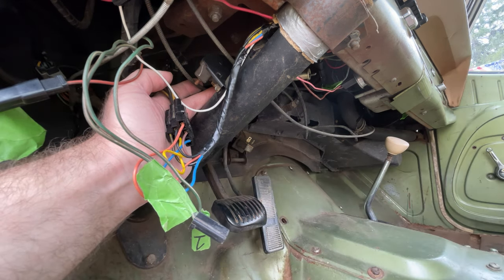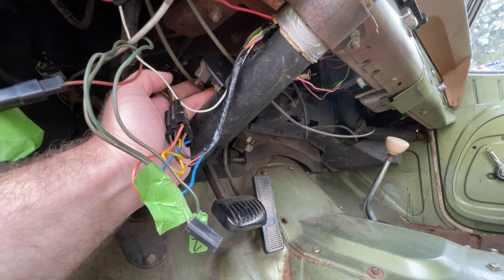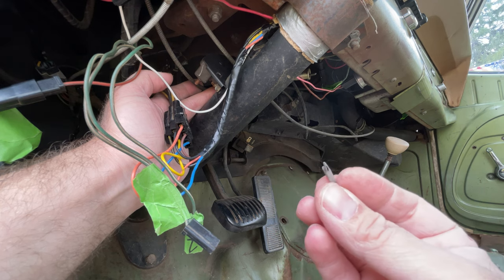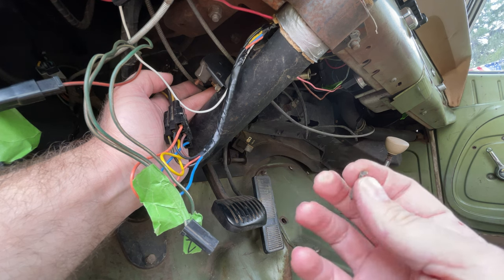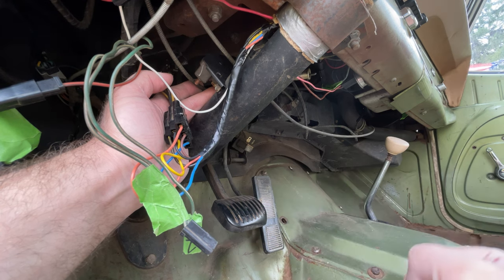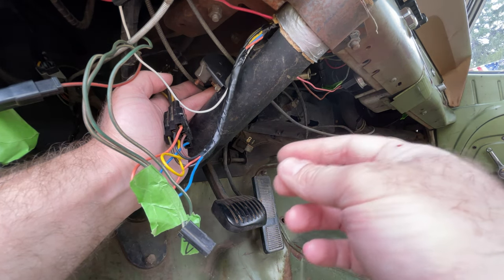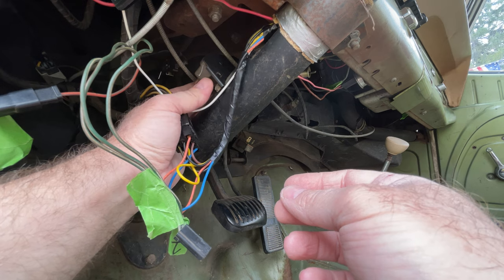I've got plenty of these little replacement connectors - they're not the exact right size. Here's one of the original ones that got cut out: they're a little thicker in the height dimension and just a shave shorter than the originals. Some of them I've tried peeling open the clasps, putting it back together, putting a dab of solder on it and pinching it up. Some of them like this one just won't come apart, which is probably a good thing - you don't want them coming apart. The ones I bought are not the right ones unfortunately - you can see how thick they are - but if you smash them down a little bit and mush them around with a pair of needle nose pliers, they'll fit in the plug and they do work. They fit snugly - at least I hope so, time will tell.